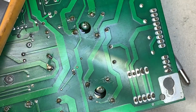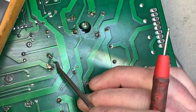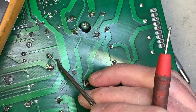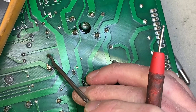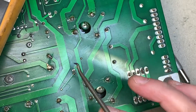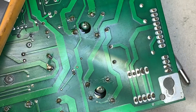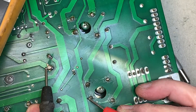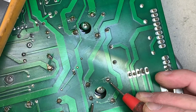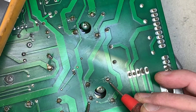Cap reinstalled and I added some tiny wires to loop around this side of the rivet and come down on the traces here, and I soldered that all together. It's kind of a nasty looking solder job, but it does get the job done. And most importantly, let's test — we do have continuity from both sides of the cap to the respective legs on bridge rectifier 2.